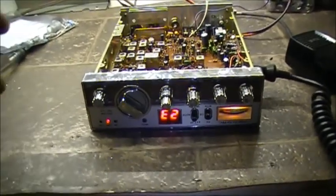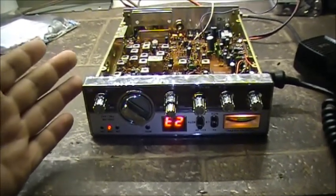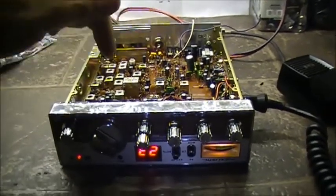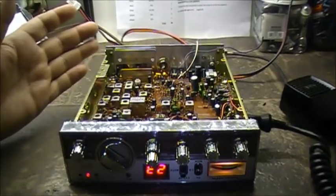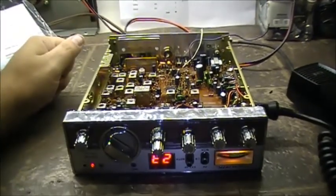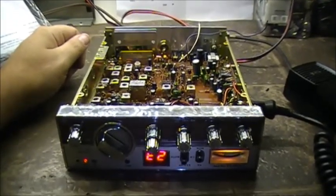If you remember back a while ago when I did a video on this 451 — you remember all the static that was in the receiver? Well, the receiver kicked in — it went from static to like deaf. Even though all the capacitors have been replaced, she is still doing that noise in the receiver. I know it's not a capacitor — they've all been replaced. I've checked the polarity of every capacitor, they're all correct, but the symptom still remains.